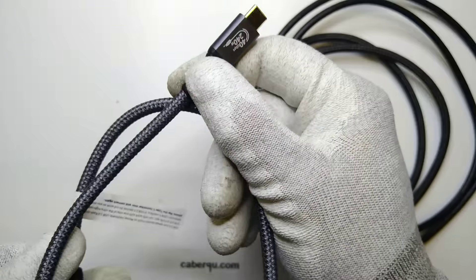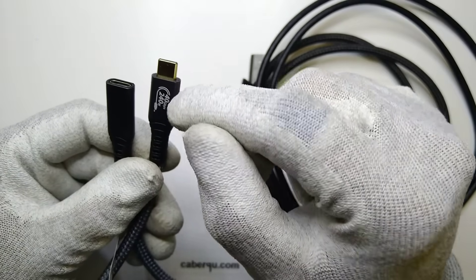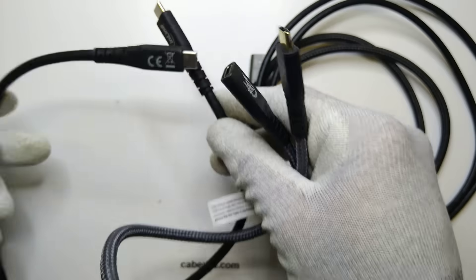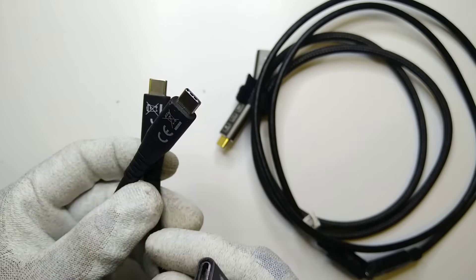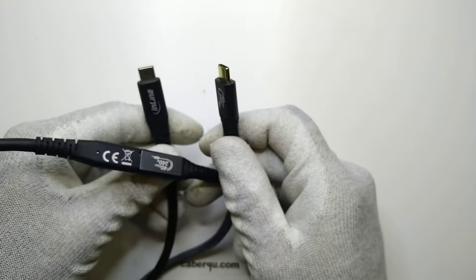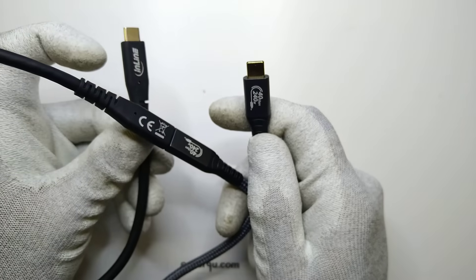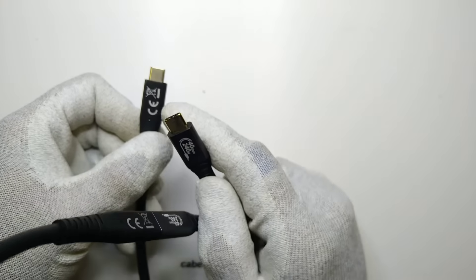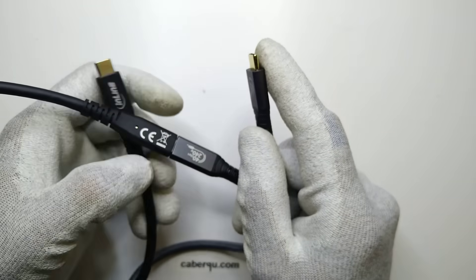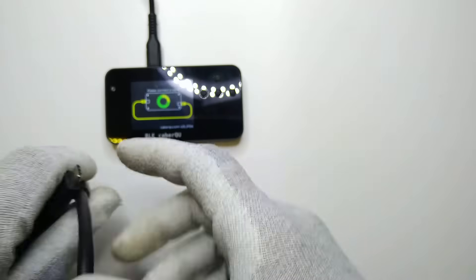The problem is that this is not a regular USB-C cable but an extension cord, and the USB Power Delivery standard does not include two cables being detected. So if I use this extension cord together with a regular USB-C male-to-male cable and connect them, I basically have two cables — but only one of them is going to advertise itself. It's a passive cable that still has active electronics inside, and if I connect this to a cable tester, only the original cable will respond and not the extension cord, which can actually be a problem and worst case be dangerous.